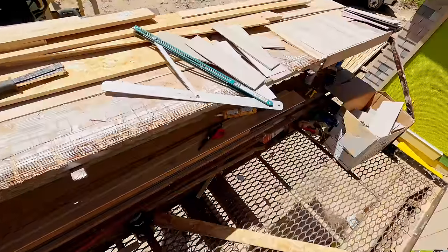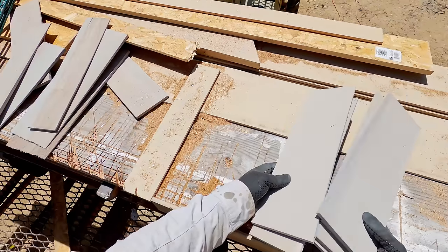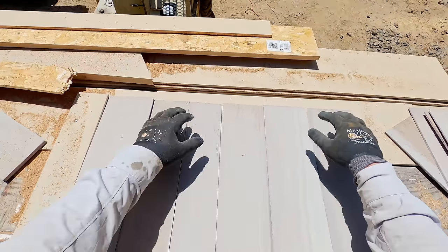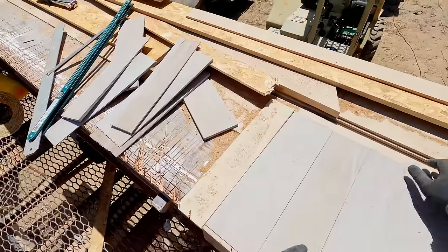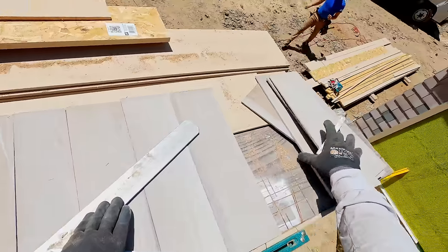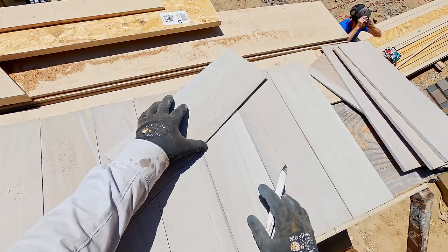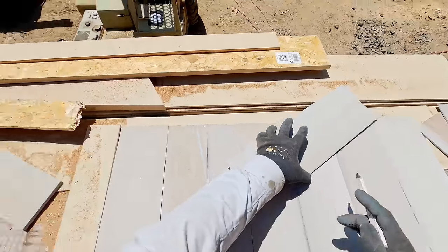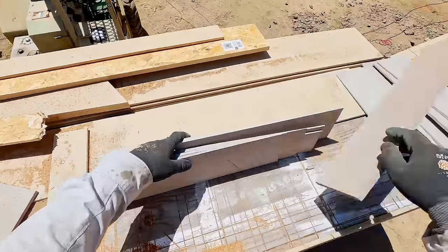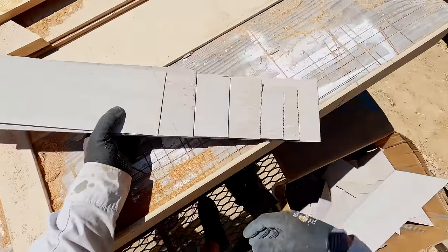I ran the slicker a couple of feet on the right because we were going to bring the shingles around the same depth as that wall, then we have a piece of trim and then the lap siding from the last video. Instead of using a board, I just use the level to draw a line and align the shingles to that — easier when working off a ladder. For the gable scribe: I pin a little piece of siding at about 90 degrees, spread the scribe out, and scribe the angle. I just roughly line those angles up and make one cut through with the saw — not perfect but it works well.